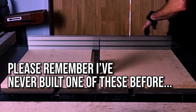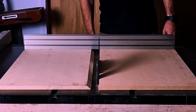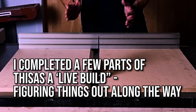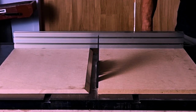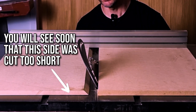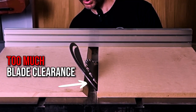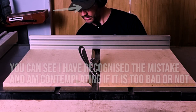The whole idea of this sled is to cut perpendicular right angles and also cut at 45 degrees if required. Since I'd only drawn this up on the computer, I needed to test whether it would actually work. I lined up the sled where it will be once assembled and double-checked that the 45-degree line gives enough clearance. There's plenty of blade clearance — probably could have come in a bit closer — but it's not going to be a zero-tolerance line.